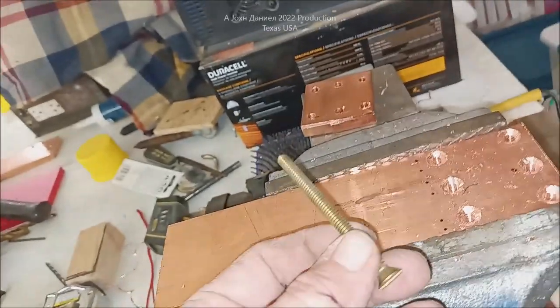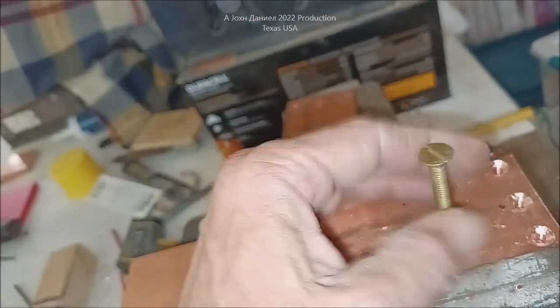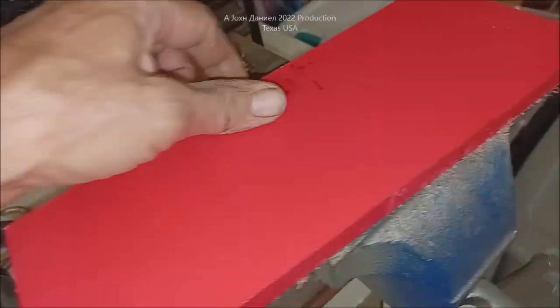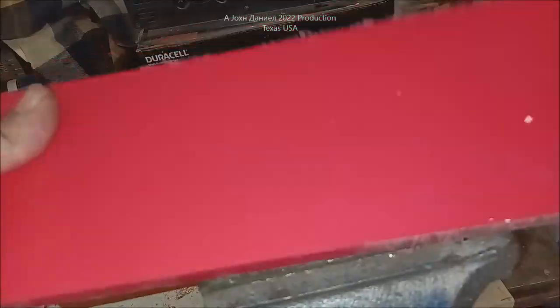Our end goal is to put these bolts in here. These bolts are not pure copper, not brass - they are 78% copper but they have tin in them, so they're a copper-tin alloy. They'll go in and then go flush with my recess that I did there with my taper. When I do that, the assembly will turn upside down and be mounted on this high-temperature HDPE material, and that itself will mount on the wall.